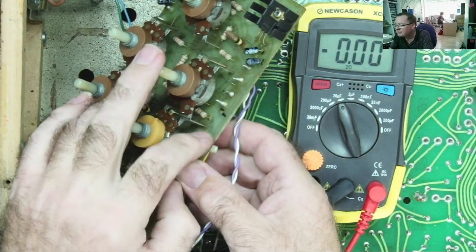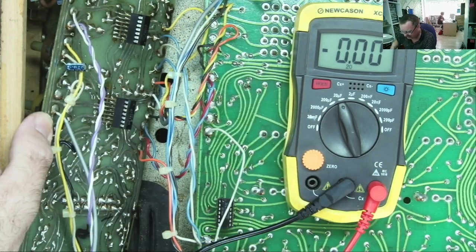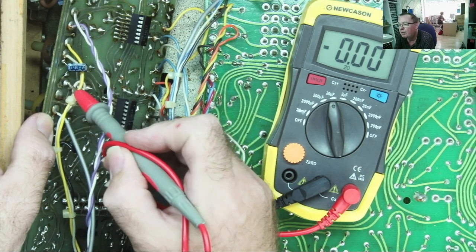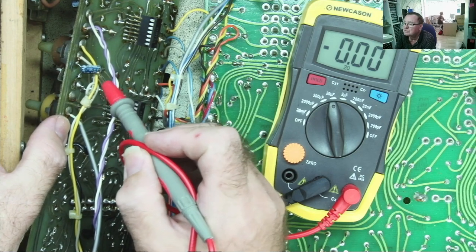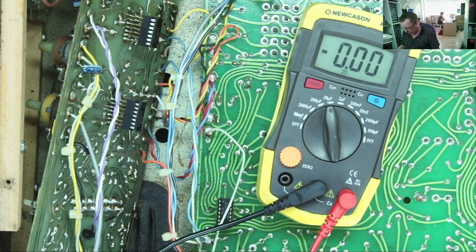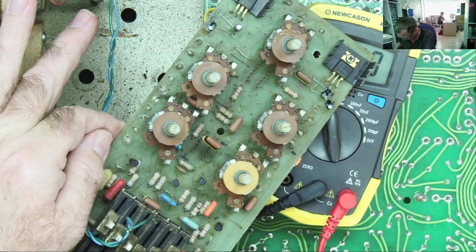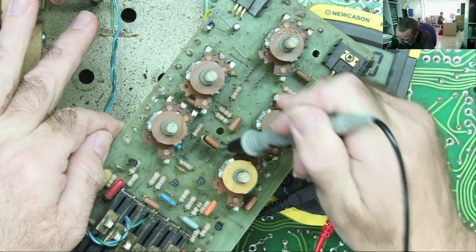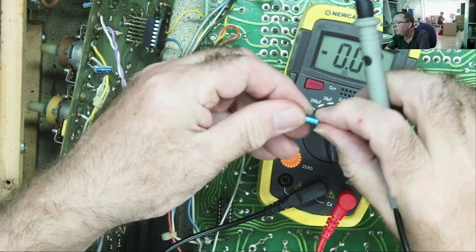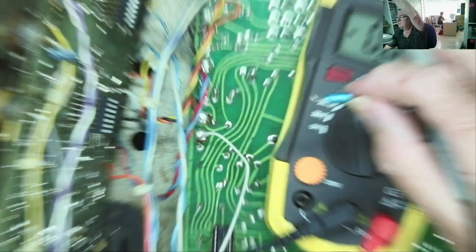I've changed the capacitor that was here. I actually fitted one across the back. I think you can see the capacitor went from this pin to this one, but that track goes to here. I only had a pull, but I have tested it. So that's a 1 microfarad, 50 volts. The one I took out read okay, to be honest. And I've just found another one I couldn't see before. It's just here. It was behind this potentiometer from the angle I was looking, so from there to there. Now this one's another 4.7. You can see it quite clearly there.